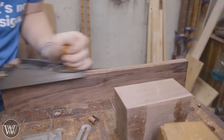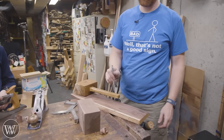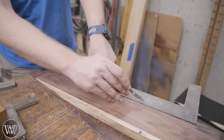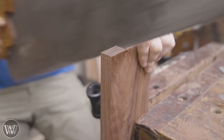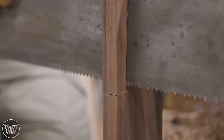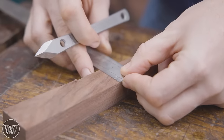For the handle, we're going to be using Bolivian rosewood. Very heavy-duty stuff. It's not the endangered Brazilian rosewood — this stuff is far more readily available and sustainably resourced. We're going to cut the handle somewhere around 16 to 18 inches long. At the top it's an inch and a half thick, and at the bottom it's three-quarter inch, and we draw a line between those two marks and rip it down. This tapered handle ends up being the wedge that holds it all together — the more you swing it, the more the head slides up onto that wedge and locks itself in place. You don't have to worry about any wedges or anything else. If you ever want to, you can tip it around and knock it out, and you have a handle you can quickly pull out of the head. It's a really cool design and it works very well.